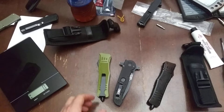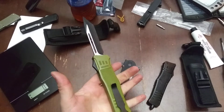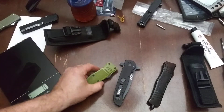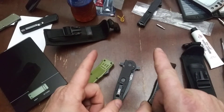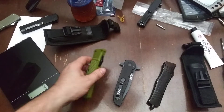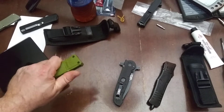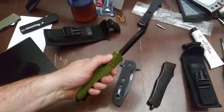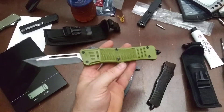So I made a modification on the spring in there. With the spring modification — basically all I did is I took that spring, it's about this long, under a certain amount of tension, and I made it just a little bit longer, which gives it significantly less tension but still enough to deploy the blade. That is so much easier now — I could do this all day. This knife was such a pain that I was thinking I might just give it away as a gift.